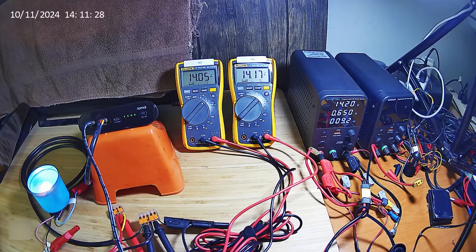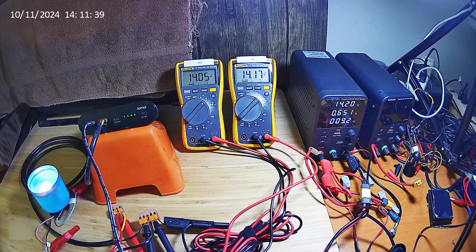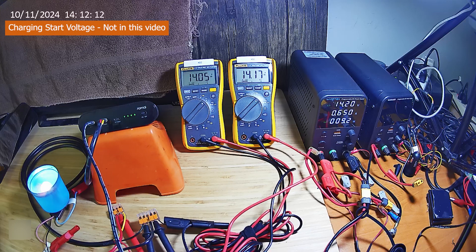I'm going to turn off the output, which is what would happen in a cigarette lighter adapter situation. Then we're going to collect the video with the security camera to observe when the load drains the battery pack down to a completely turned-off level. I want to see if the weird charge state happens again in cigarette lighter adapter mode, where it only went to 4 volts — which occurred after I let the battery pack deplete and left it in an on state for about a day and a half. When I turned it on, it wouldn't start fully charging until I removed the load from the VCC out. But we'll see what happens this time.